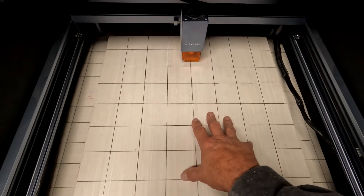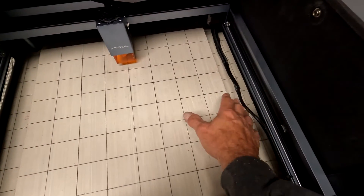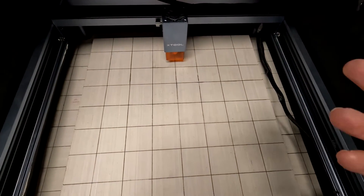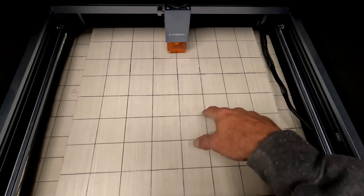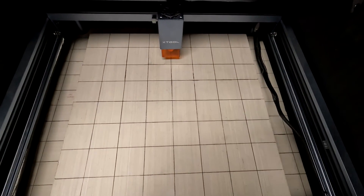Here's my finished product. I've got three pieces of half-inch plywood that I gridded out. I can lay them on top of my bottom piece so I can line things up and keep my pieces straight and center. Nothing spectacular, nothing special — it may give you some ideas. You can number these out, put measurements on here, or make your own full grid if you wanted to. It's cheaper than buying one if you've got a piece of plywood laying around.